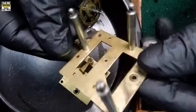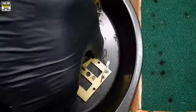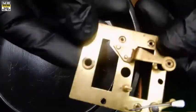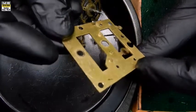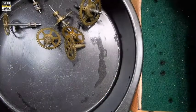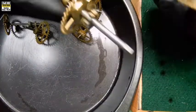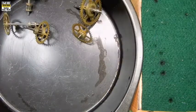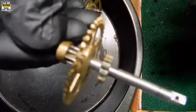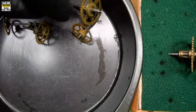The parts have now returned from the ultrasonic cleaner. As you can see, they look pretty clean - nice and shiny. The parts were in the cleaner for five minutes, then we took them out and washed them in cold water to remove the ultrasonic cleaner fluid, then in some warm water for a second rinse, then into a vat of naphtha - also known as lighter fluid - and once that had removed most of the water from the parts, they were put on a dry cloth and I ran over them with a heat gun on low speed.